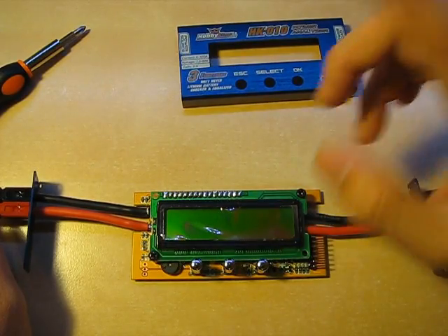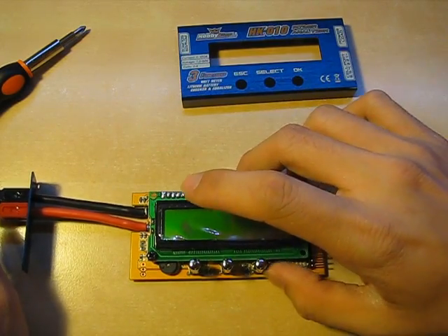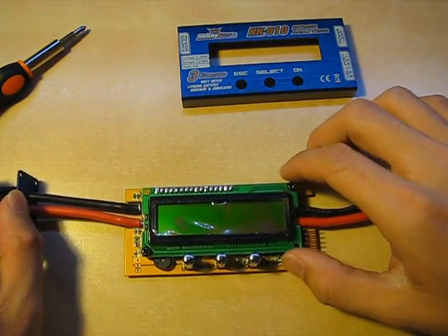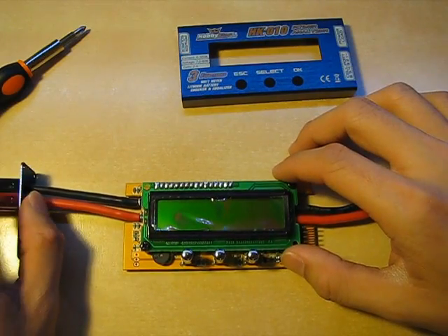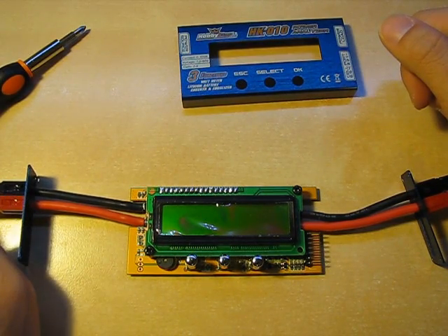The current sense and voltage sense use an LM358 and an LM324 chip under the hood — cheap op-amps, but they work. I can't really inspect the voltage sense resistive divider to assess its precision, but voltage is accurate overall through the leads.